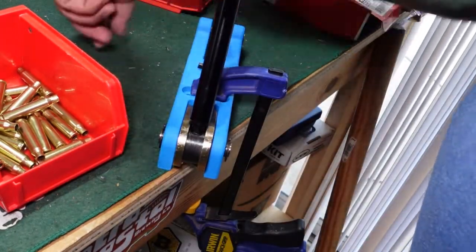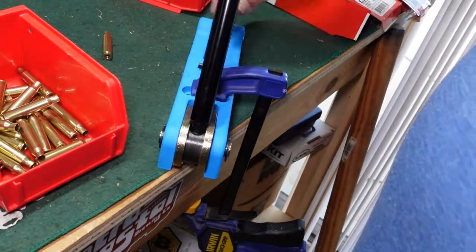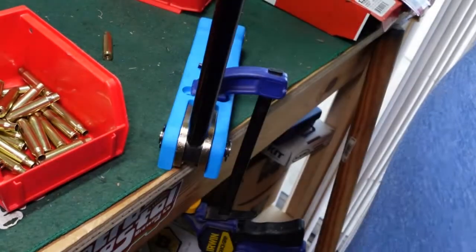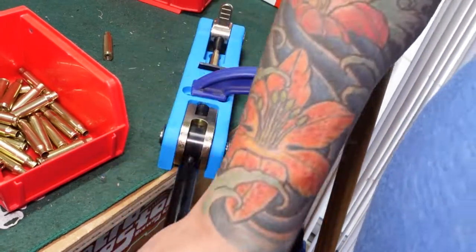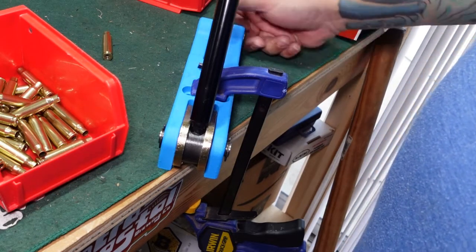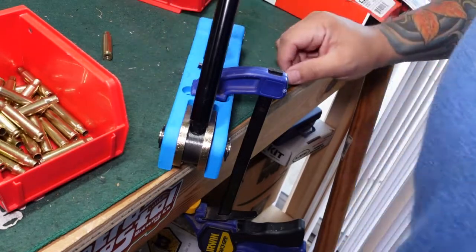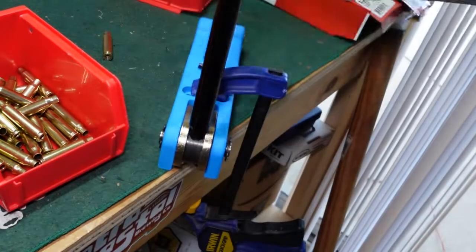I've also given you guys some tips on how to avoid having to either spend more money or go through steps that are unnecessary. And after this, really the last thing that's missing is to load them. Put them through the machine, add a new primer, insert powder, expand the case mouth, insert the bullet and crimp it. And that's going to happen on the next video. So if you stay with me, we will complete this process in no time.